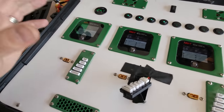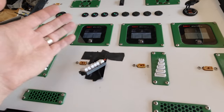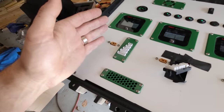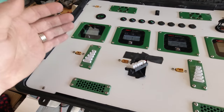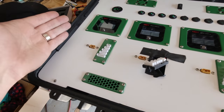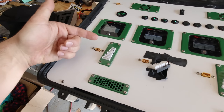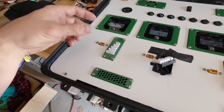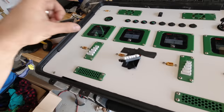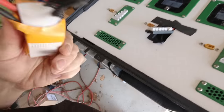A lot of people ask me why I use separate chargers — why not just use a parallel board or something like that? To be honest, the reason is that when I'm practicing, especially on the Racer 4, if I crash, I'm just going to not finish flying that battery because the batteries only last for like a minute and a half, two minutes. I can plug it in and start charging it on its own without having to balance charge it before swapping in the next one. Not having them on a parallel board allows me to just plug in a new one, double tap, and it's charging. I just walk away and don't worry about it anymore.